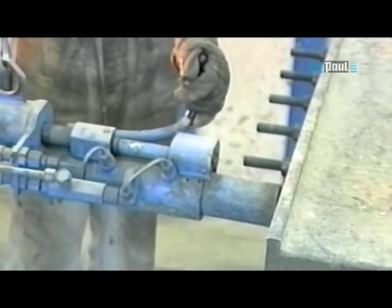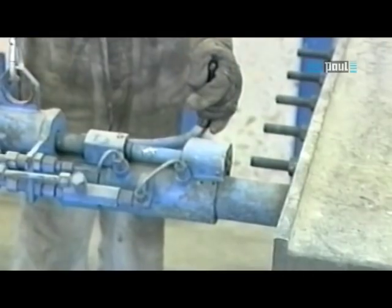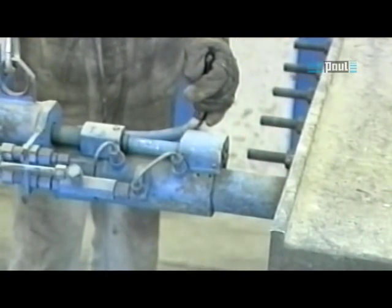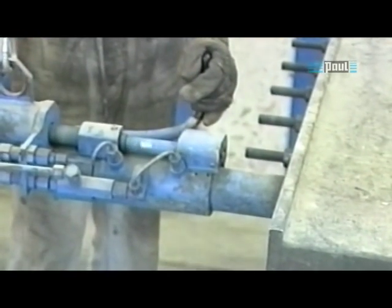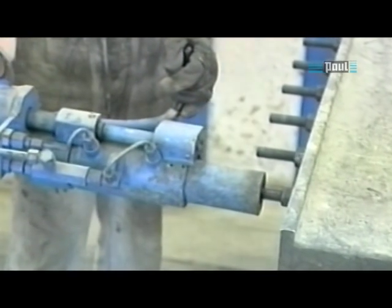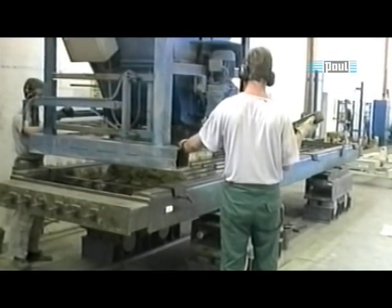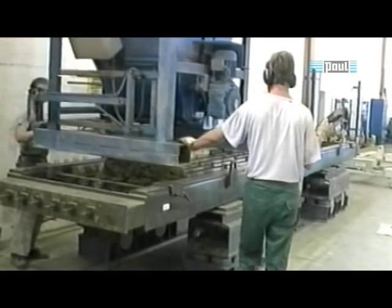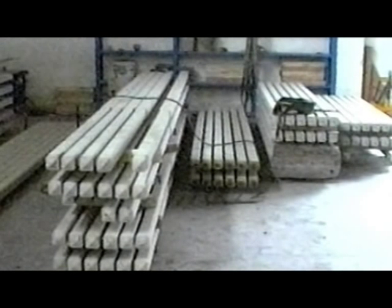First, the stressing jack is automatically screwed onto the stressing spindle. The tensioning anchor, including anchor nut, is fastened to the stressing spindle. The screwing on and off operations are controlled electrically. Tensioning now takes place, and the anchor nut is screwed firmly against the mould. Thereafter, the stressing jack is screwed off the stressing spindle. Posts from 2.2 metres in length can be manufactured with the screw jack shown. The posts are used by the German Railway in signal engineering.